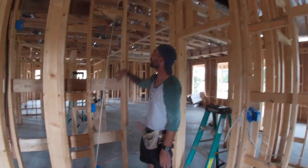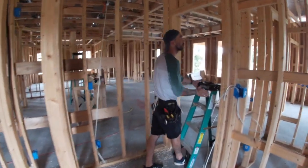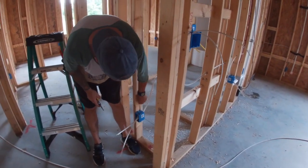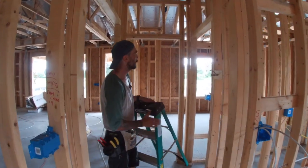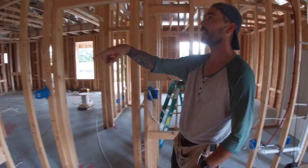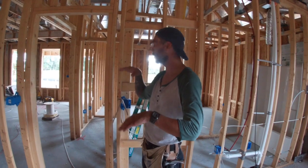I have a little bit extra in this box because I'm going to staple when I get both wires down here — a couple here and a couple there. It doesn't matter how you do this as long as everything is getting powered. That's all the power for this room's jumping circuit. I went to that hall receptacle and came back in here. Now I'm going to go to the other room, take it from that switch box which is the closest, connect that, and then start looping out that bedroom with the bathroom.